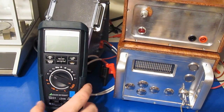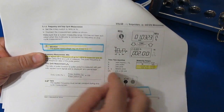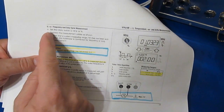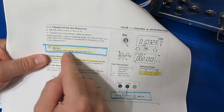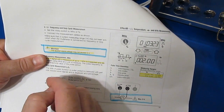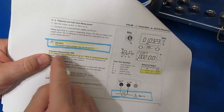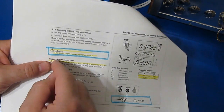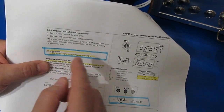Before we do this there's one last test I'd like to show you with the meter. Looking at the manual, I had pointed this out very early on when I first started looking at the different Gossen meters - there was a note that when you're measuring frequency and duty cycle, the applied signal voltage may not exceed 5 volts. So the idea is that you're supposed to use this to look at digital signals, and when I'm functionally testing this I'm looking at a CMOS type output that drives rail to rail, which is why you see it going all the way up to 5 volts.